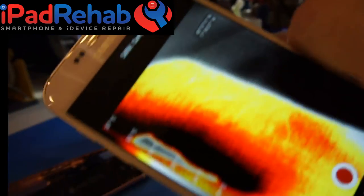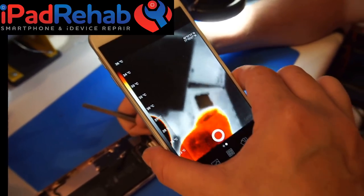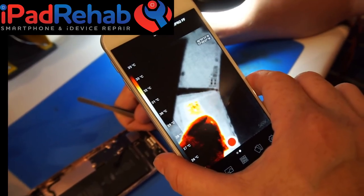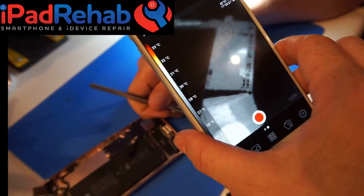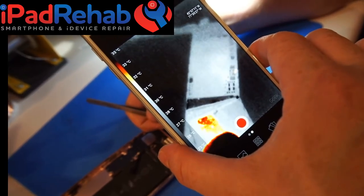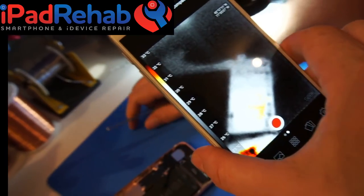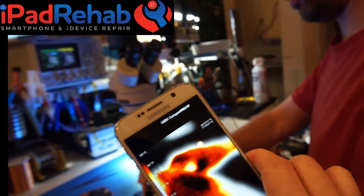Let's flip it over and look at the other side. You can see the flash at the crack as well. The camera can't differentiate the crack from the cap — they show the same amount of heat. Camera can't help us more than conventional methods on this one. Honestly, if you didn't already know this was a 1V8 SDRAM short, seeing those flashes of heat wouldn't help — without a circuit overlay you wouldn't know which component it was.